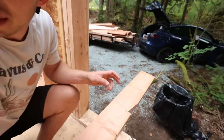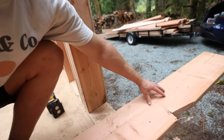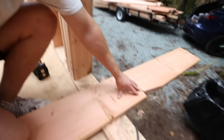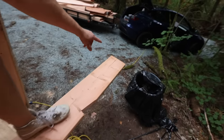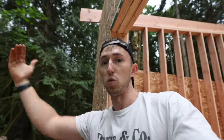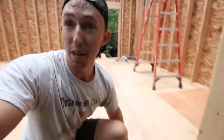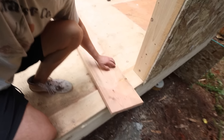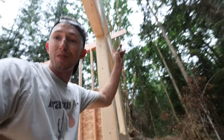So I just brought this first piece into the home, which I'm going to be setting up as like a template area — I'm going to measure all of the other roofing rafters based off of this one. You see I got the little widow's peak in there and I beveled the end. But this cut right there is perfectly level with the ground, which is where we'll attach our fascia siding and the cedar to the underside. And then it's the same thing on the flip side — little widow's peak there, and this is beveled to keep perfectly flush right there.